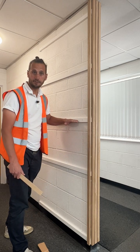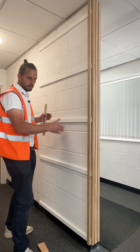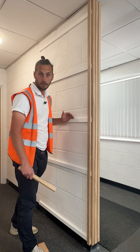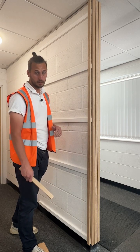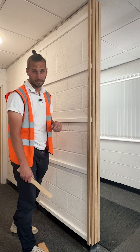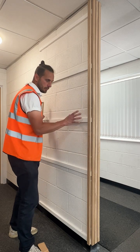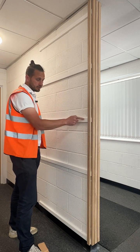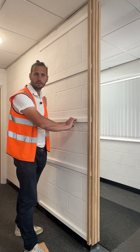Because we've gone for vertical battening, I've put some horizontal battens in behind so that we can pin the vertical pieces to those and they can carry them. I've just gone for basic American poplar, but you can use cheap pine — some two-by-one from your local DIY merchant. You're not really going to see it, but we went for poplar because it takes a great paint coat and we can get it back to the same coloring. The idea is to make those battens a bit nude so that the feature timber stands out rather than what you're pinning it to.